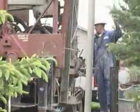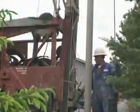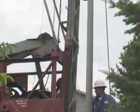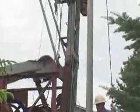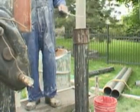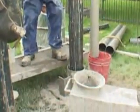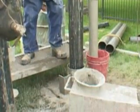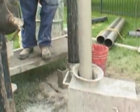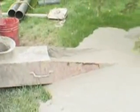The drilling action, in conjunction with approximately 5 gallons of introduced water, mixes with the cuttings, which require baling after approximately 4 feet of drilling. This flushing system requires the drill string to be tripped out of the hole and the baler to be tripped in. The baler is simply a hollow tube with a check valve on the bottom, which fills with the cutting slurry mixture. The action of the dart valve enables the baler to collect cuttings for ID and recording purposes, as per Regulation 903, as well as removing accumulating cuttings by dumping them in the mudspout.